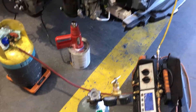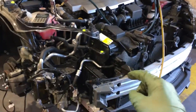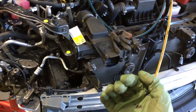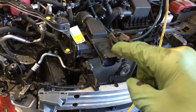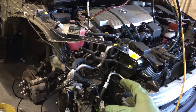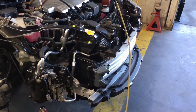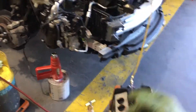Now I'm going to use nitrogen to bleed into the system to make it a positive pressure, so when the technician opens any of the lines, it's dry nitrogen coming out. It's not moist, oxygen-bearing atmospheric air being sucked into a vacuum, flashing off to a liquid and completely saturating all the oil with water — literally water droplets. As soon as you break that vacuum, the atmosphere flashes off into water.